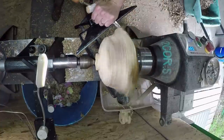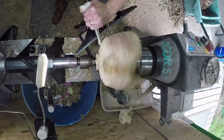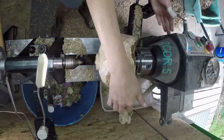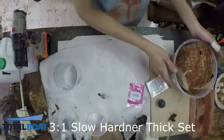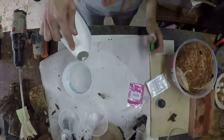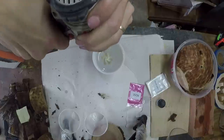I cast the bark in with this piece. The wood was really dry and punky, had some cracks in it, and I really wanted to turn it without resin, but in order to save it, it was kind of a must. So I'm shaping it to fit in my Rubbermaid mold from the Dollar Tree — those work really well and pop out easy. I'm going to cast it in Total Boat three-to-one with rose color and silver pearl, along with interference violet, which is what gave it that purple look. It looks really pink when poured, but in the final piece it looks more purple.